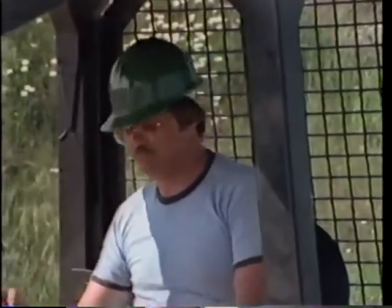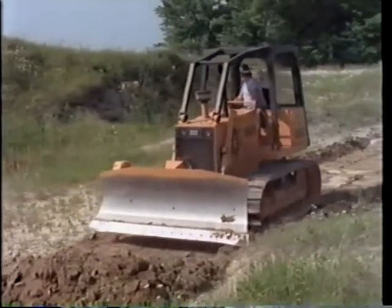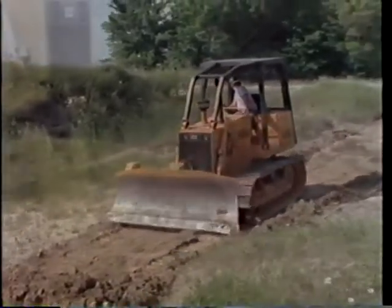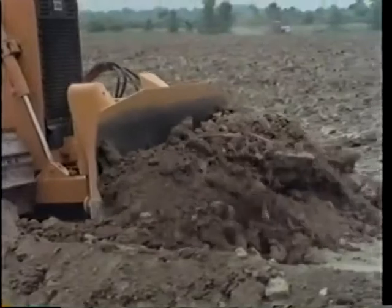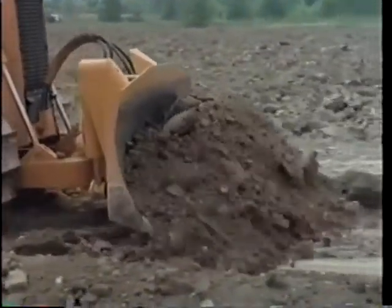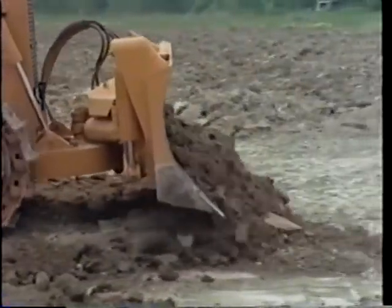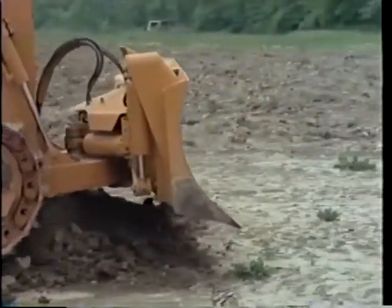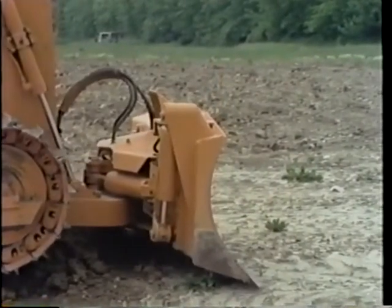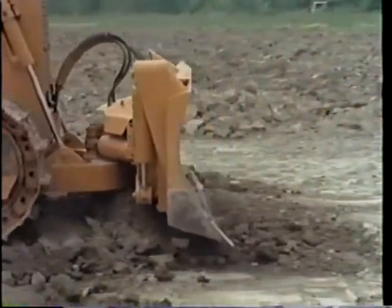When you've moved a load, look around to see that nothing's in the way. Back up the slope and doze another load down the slope. If you want to smooth out piles of material, first spread it by going forward, feathering the material ahead of and under the blade. You can back drag to get a smoother surface — put the blade on the ground, put the machine in reverse, and the control forward in float position.